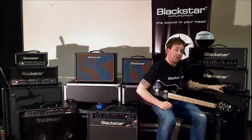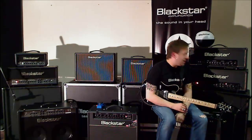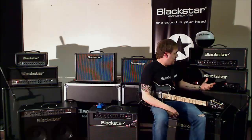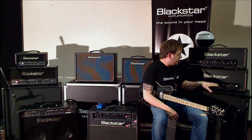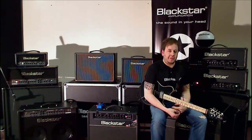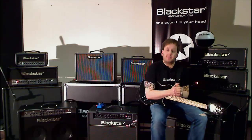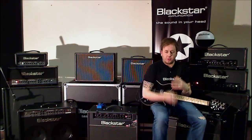And then even more so with our red channel, OD2. I've got the gain around about 3 o'clock here, so it's quite high. Let me just mute that channel so it's not making noise. I'm going to go from my British high gain, if you will, right through to a tighter American sound utilizing the ISF. If you don't know what ISF is, it's a patent to Blackstar, and it stands for Infinite Shape Feature. It allows you to really control the sound that you're looking for.